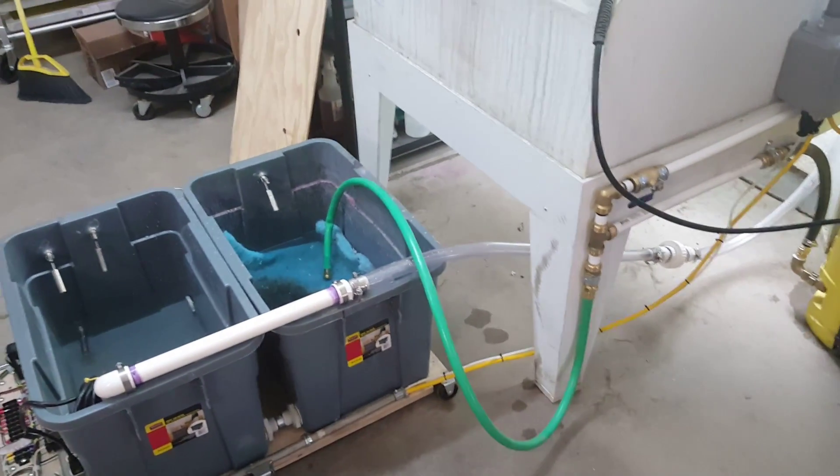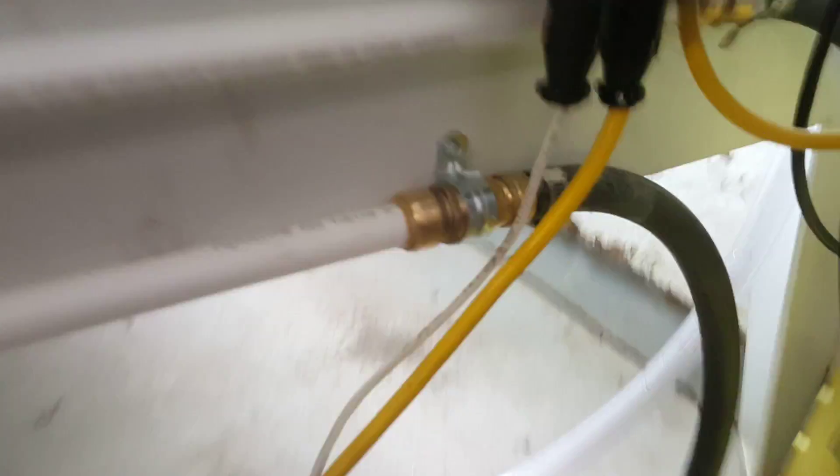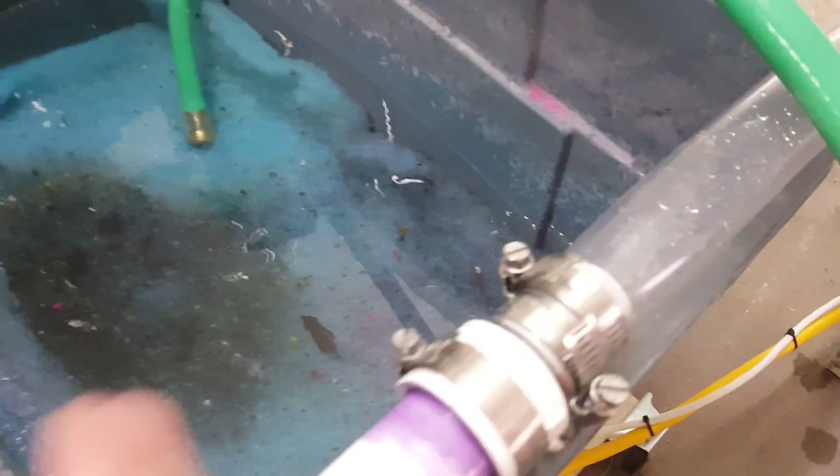Here are the bins and pump assembly. I also made an extender hose so I can run the pump while it's pulled out. The drain off the sink is pushed backwards, and the pipe hole is at the back of the first tank — so material falls into that tank. Down at the bottom I have bulkhead fittings with a piece of pipe connecting both tanks, and another bulkhead fitting on the other side, which basically connects the two tanks into one through the bottom.